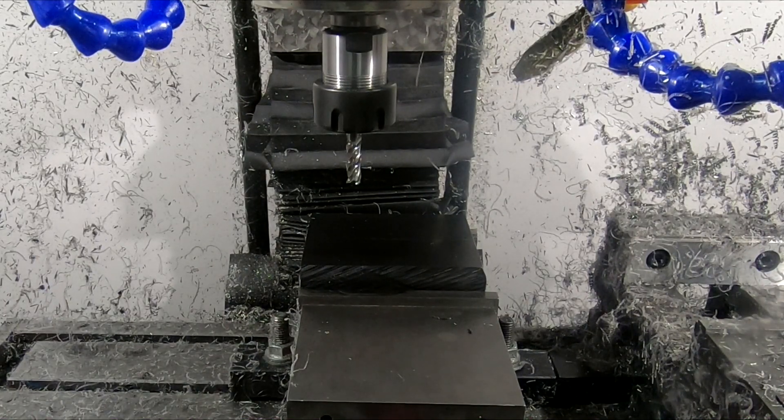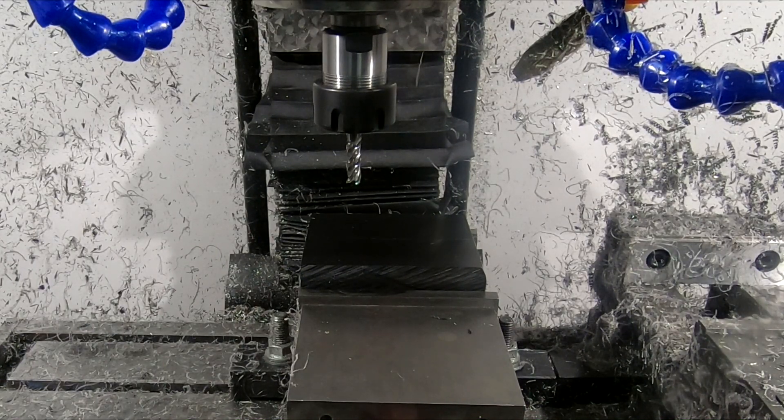The facing is finished. I have changed to an 8mm end mill and will now start to make the first contour. I'm using an adaptive toolpath from Fusion 360 to make the first pass, and then some boring and contour operations after that. There will be some tool changes, but let's start with the adaptive.